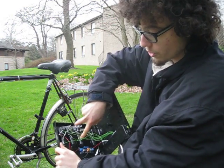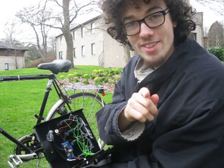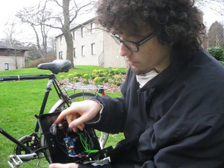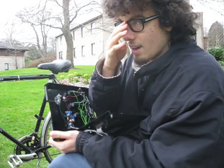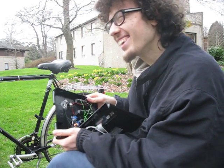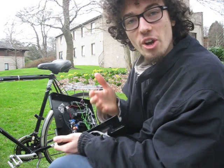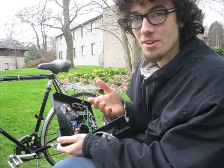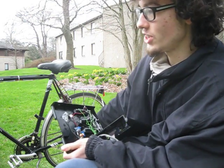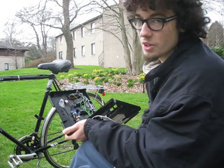Each dynamo goes across a different set of capacitors and rectifiers. What we've been working on is this MOSFET. We were looking in the drawer for MOSFETs, and we only found one — a 600 volt MOSFET. That's meant to be used in mains power stuff, not for little projects like this, because the most this can generate is about 32 volts when we tested it. So it wasn't going to work.